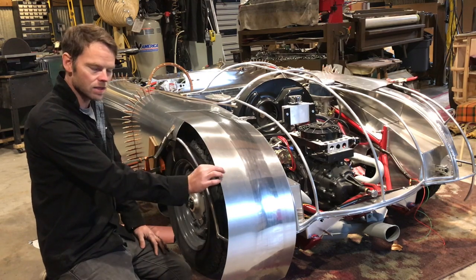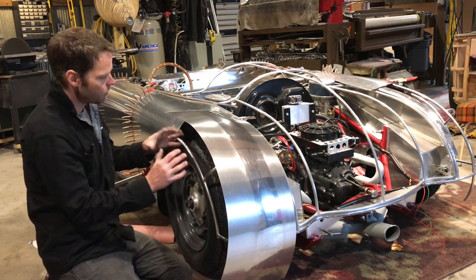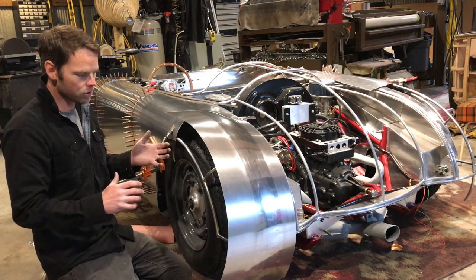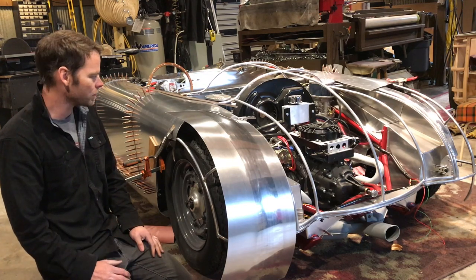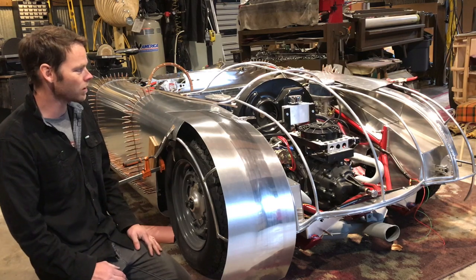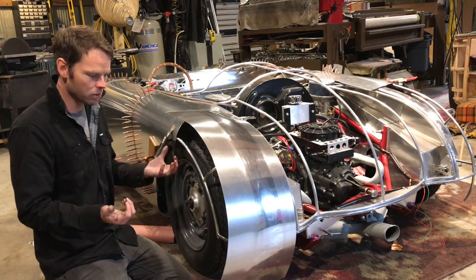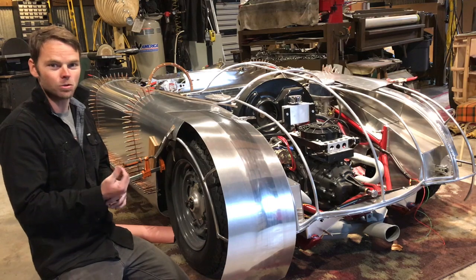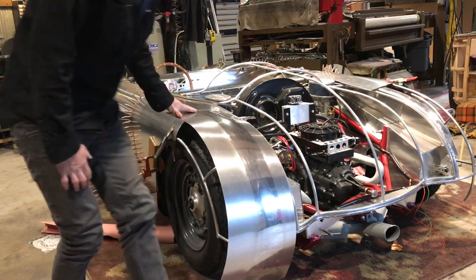So this, what is now 60 thousandths, is gonna become maybe 70 thousandths by the time I'm done shrinking this all in together. But what's so beautiful about metal is that it pushes into itself. You don't have any wrinkles or pleats or creases if you're doing it right. Now, the learning process, you're gonna have all of that, and you can't get angry at yourself because it's a part of learning. But this is what I love about shaping aluminum. I've only worked with steel a couple of times, to be honest with you, but this aluminum will just absorb itself, it'll get thicker, you'll change the molecular structure of it, and to me it becomes a thing of beauty as it basically is like a fine suit being fit to this skeleton here. That's what we'll do next. On the reciprocating hammer, we'll start shrinking this.